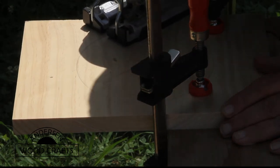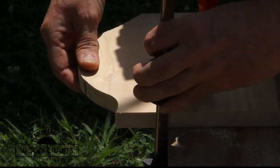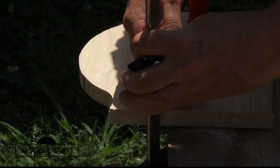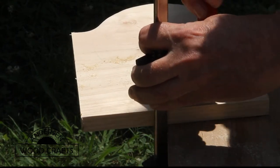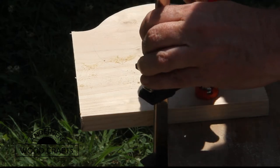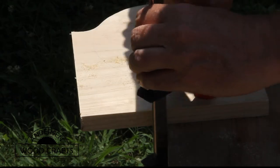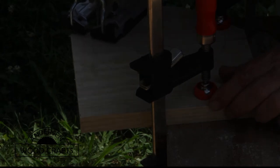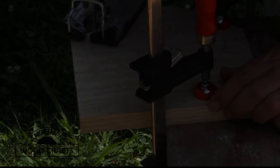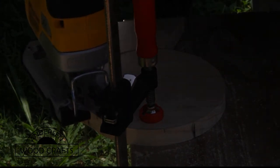You won't be able to make the cut in one pass. You're going to have to cut, unclamp it, reclamp it, position it to an area that hasn't been cut yet, and then cut again — probably three or four times. Another tool you could use is a bandsaw, if you're lucky enough to have one. Another option is a scroll saw, though when pieces start getting too thick, the scroll saw is no longer of use. And if you really want to get down and dirty with a hand saw, the coping saw would be the best tool for cutting a circle.